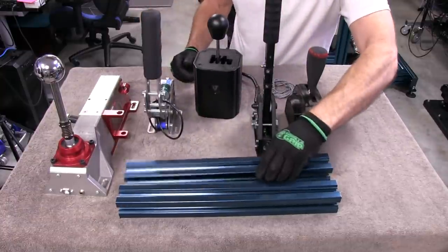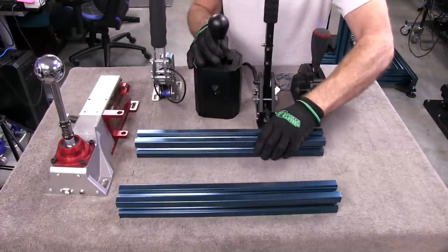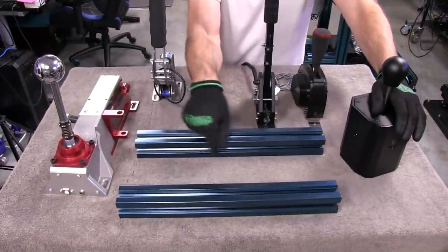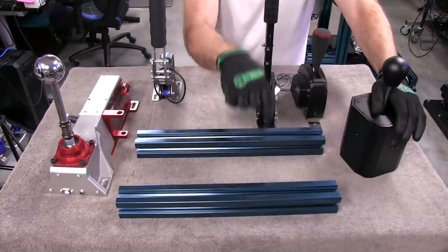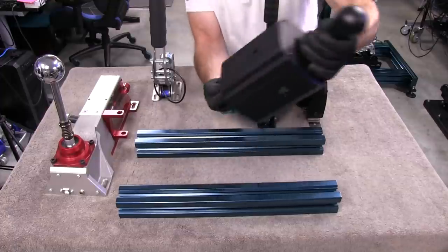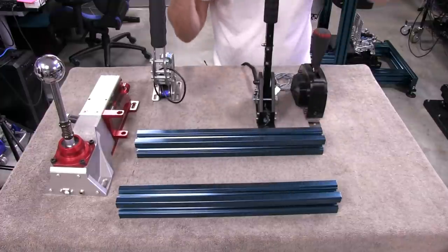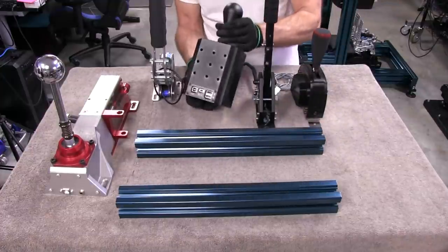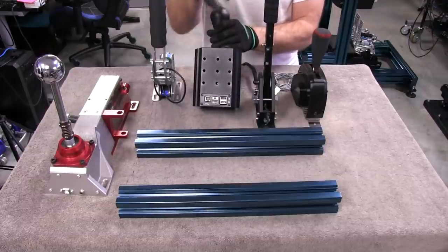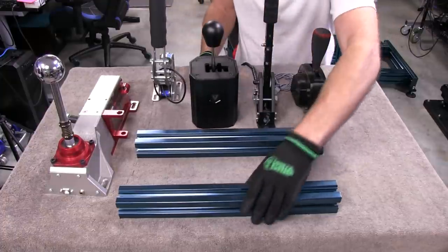Let me get them over here a second. Yeah, I can get enough space here. Pull these guys back a little. We could put these, still mount our cross pieces, and then on the sides, on these inside pieces here, other corner brackets with just holes in them, and then we could put this over those corner brackets and just run our bolts from underneath and secure it that way. So again, just different ways to do things. And by the way, this manufacturer does have, and a lot of them, most of them do, some kind of adapter bracket that enables you to mount these to profile or something else, and just drill holes through it.